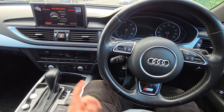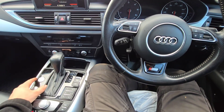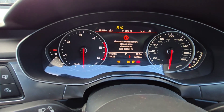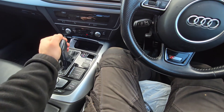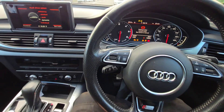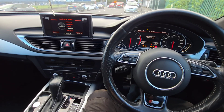I came out to drive the car, went to turn a corner, and I've broken down — so I'm in the street. Starting the engine now, I've got all the lights on the dash. You can see there's no engine RPM and I can't select any gears, though luckily I can get it into neutral. The dash has gone mad. I did hit a couple of small bumps in the road and that's when I noticed this happened.